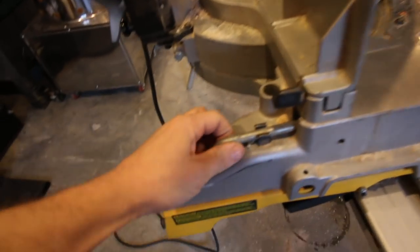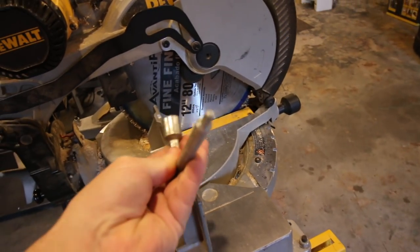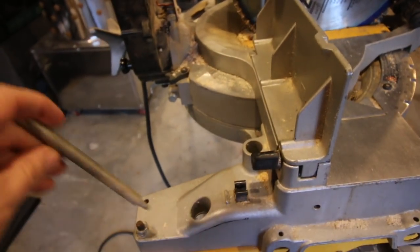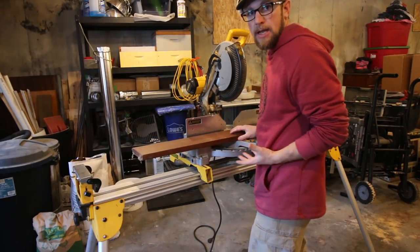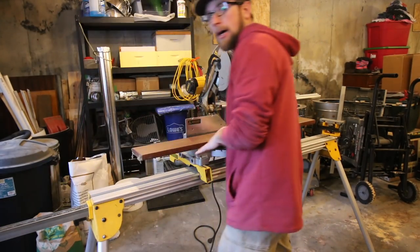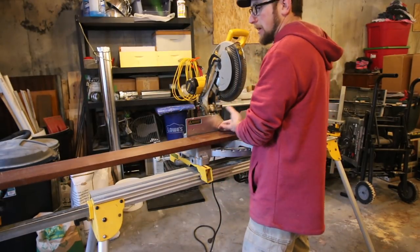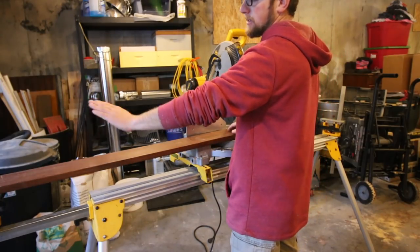Most chop saws have a place to hold your tool. This is the tool you need to change your blade — you've got a Torx bit on one end to undo your blade cage, take that off, then undo your nut and change your blade. You can loosen the knob, slide your arms out, and cut long 2x6s, 2x8s — just adjust your arm and it supports your board. When you're cutting, the arm on the excess end catches it so it's not just falling and pinching your blade.